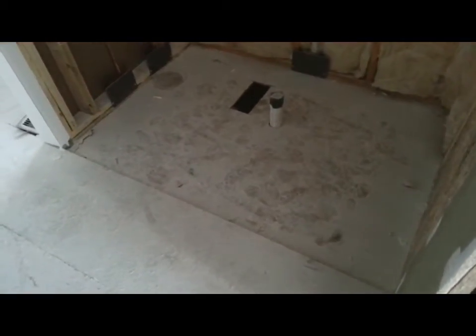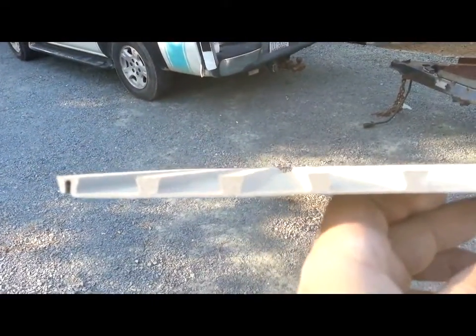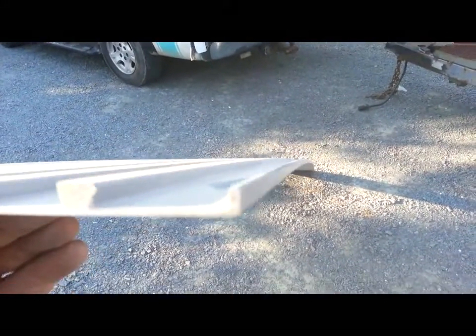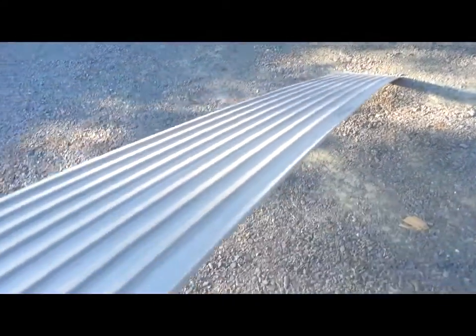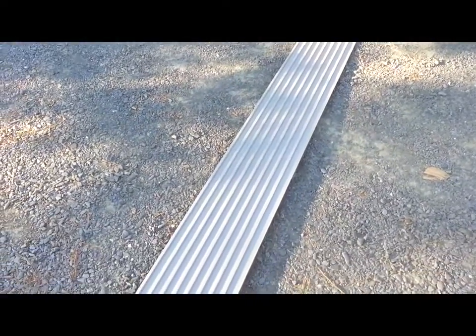So this is curbless shower floor day one. This is the TI Pro Board product. You can see it's a fiberglass material with little channels that go all the way down. We lay this across the top of the floor joists in place of the subfloor underlayment. There's a little notch on one end that goes over the corresponding ridge on the other end — they all lock together. It's fairly flimsy at first, but when we fill it up with thinset and let it dry, it dries rock hard. This strip is eight feet long and we'll be replacing the entire floor system with TI Pro Board.